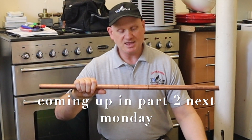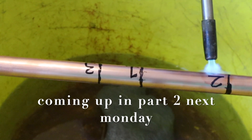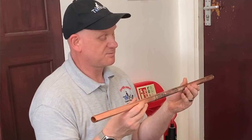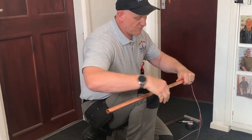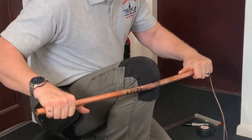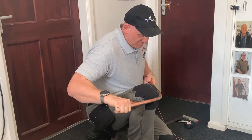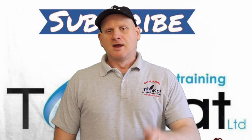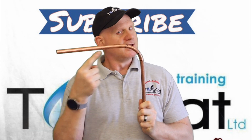It's called annealing, and I'm going to heat up between these sections here to make the copper softer. I've got a rag here — I'm just going to put it straight over the pipe and cool it instantly. After cooling it down from annealing, this is going to be an even pull. I start right on the corner of my knee there and I can start to pull and gradually bend the pipe. Where it's rippling because the spring is stretched massively. What I need to do now is pull it back a little bit, back to 90 degrees. That, ladies and gentlemen, is how you bend a perfect 90 degree bend using a bending spring in 15mm tube.